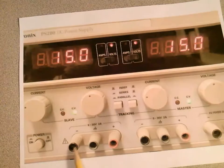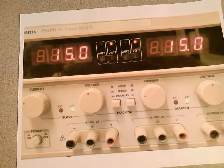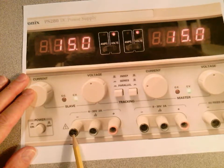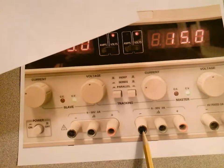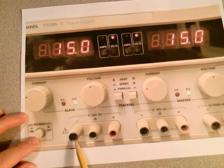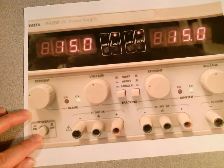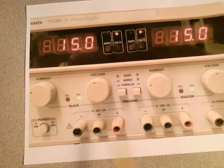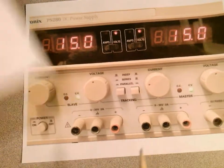For the 20-volt supply, here's the plus side and here's the negative side. Notice that the negative side of the 10-volt supply is connected directly to the negative side of the 20-volt supply. That means you can put a banana plug and make a connection between these two points. Rather than running both wires separately over to the circuit board, you connect this point to this point, then run one wire over. This point supplies 10 volts and this point supplies 20 volts — that's called a floating ground.